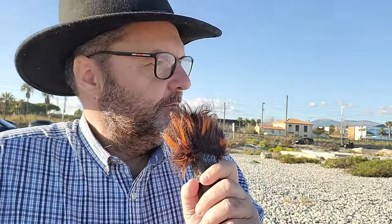Where do you put that if you don't have the space? I mean, even here at the beach, I could not do that because there's not enough support anywhere to have that. So I could use, of course, my 12 meter spider beam mast, and actually I plan on doing that with maybe like a 10 or 11 meter wire, using the Mad Dog coil, which would allow me to again use 80 meters with a more efficient antenna. But the 5 meter whip does work, and I have to say I'm pretty surprised.